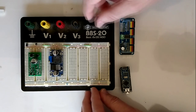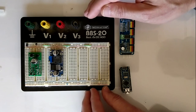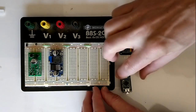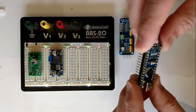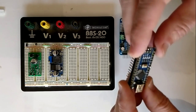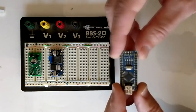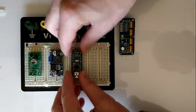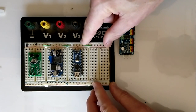A linear regulator would be sufficient for just powering the processor, but for powering servos I prefer something with higher efficiency. The next module is the Arduino Nano, which is a scaled-down version of the Arduino Uno — it has the same processor but the board size is much smaller. For our purposes of making this decoder, that's kind of perfect because it fits the breadboard with no problem, taking just one field like everything else.